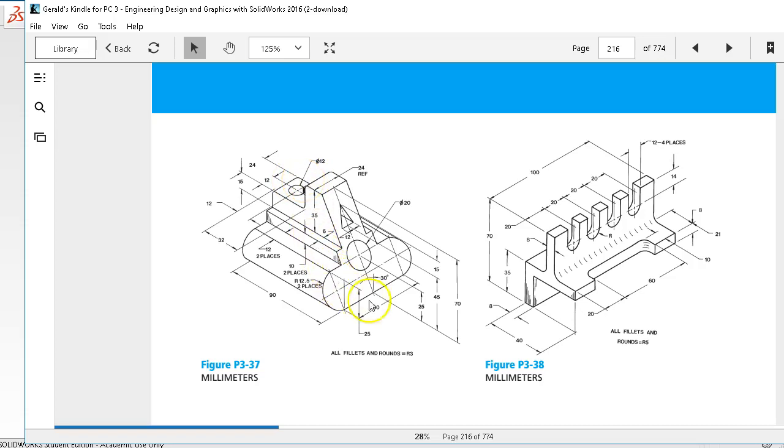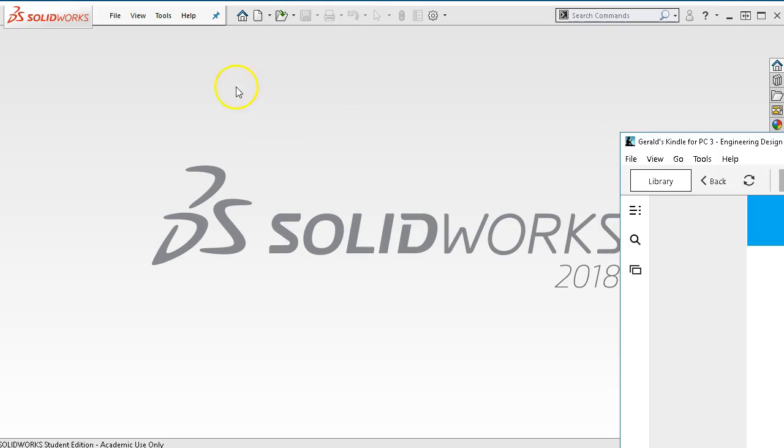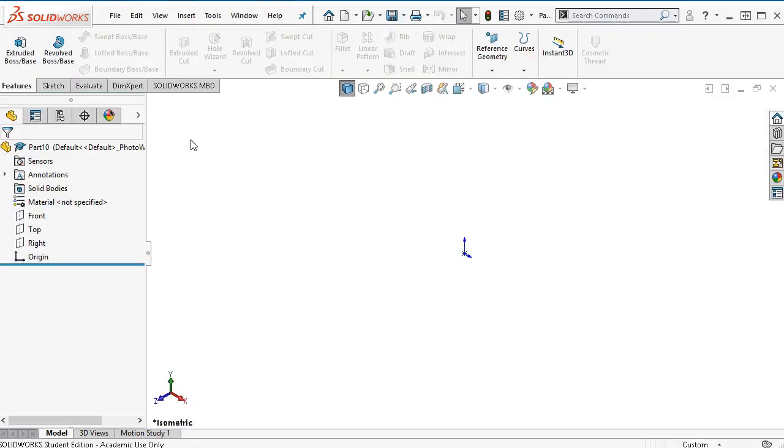The circular face — we're given a diameter of 20 and 25 off, so that being centerline. The triangle kind of shows it going linear and the face will be kind of a lip, so making the assumption that that's linear and without a depth that it goes all the way through. I'll fly that out of the way and open up a new part in millimeters, then open up the sketch on the right plane.